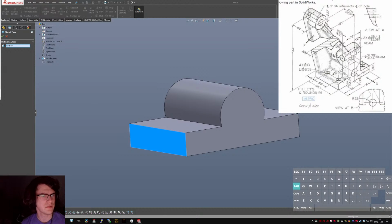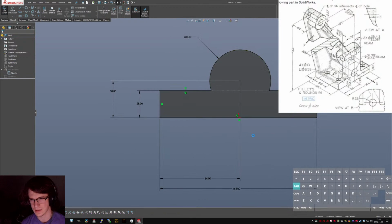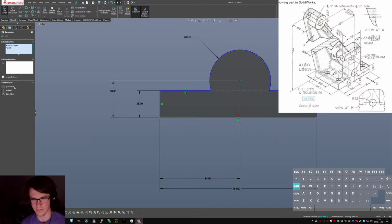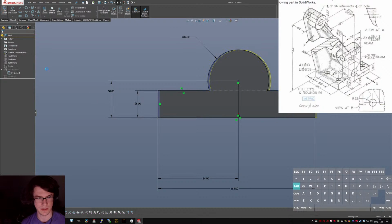Oh, it's supposed to be 32 millimeters back from the center line of that hole. It's dumb. Okay, so what I'm going to do then is come over here, and instead of making that midpoint, I'm going to make that vertical so that this becomes on the center plane and it saves me some effort. And then I'll restore the coincident constraint to put that where I want it.